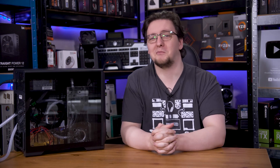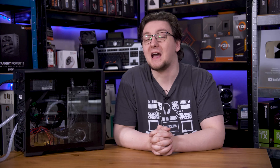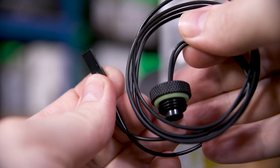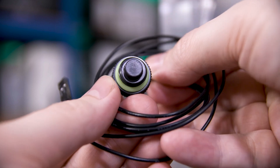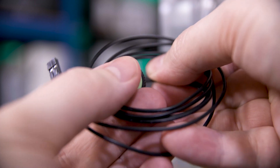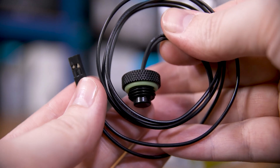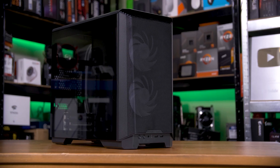There are a couple of other nice features on the board though: two 4-pin PWM fan headers, which the ESP can control via PWM and read the fan speed, and a 2-pin header for an NTC thermistor — a negative temperature coefficient thermistor. Basically it's just a resistor that changes its resistance with heat. This specific one is built into a water cooling fitting, which can monitor the water temperature and, at least in theory, adjust the heating or cooling accordingly.